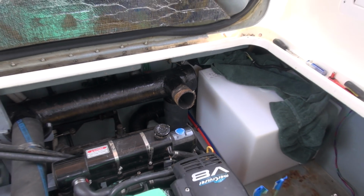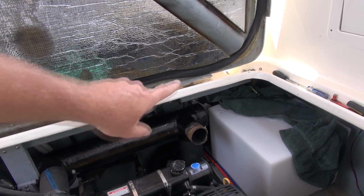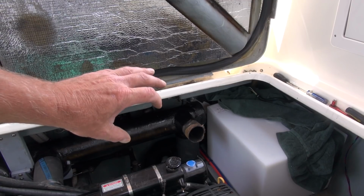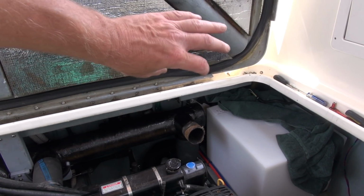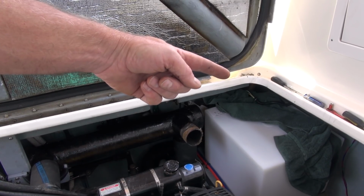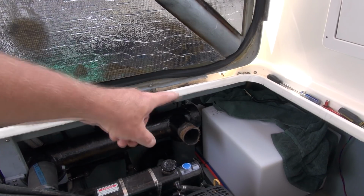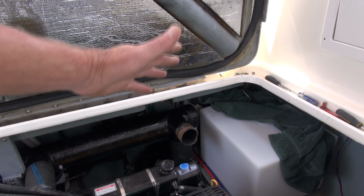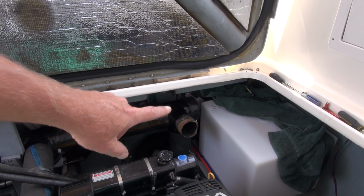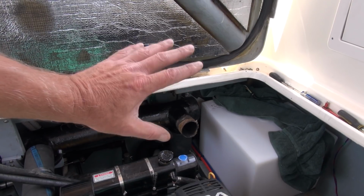I've got that all unclamped, as well as there is an auxiliary muffler off the side, because from the top of this crossover there's about a 2-inch tube that goes out to an auxiliary muffler, and that's the exhaust that spills over the side of the boat. And of course it needs a lot of pressure then to push the water underneath the boat, so that's why they have that, almost like a temporary bypass at least. So I had that unclamped yesterday. Now I just reclamped it back before I forget,